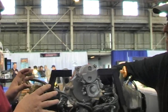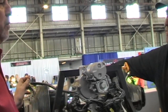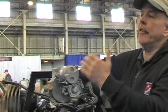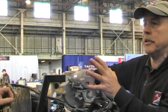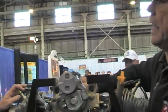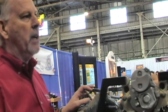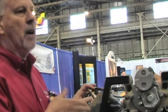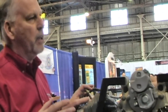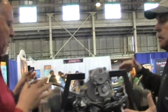The Bendix mag is very robust but heavier, so we went with the Slick ignition system for lightweight. We did do some automotive ignition testing but went back to reliable aircraft ignition. The difference in weight between the A and the D is roughly 28 to 29 pounds. This engine as you see it now is 199 pounds — that's the basic engine without exhaust or other accessories.